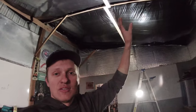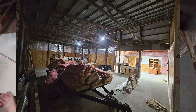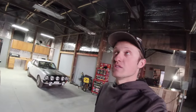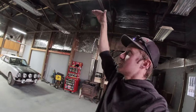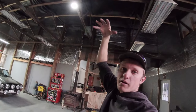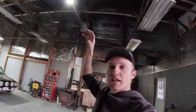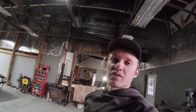To insulate the ceiling under that vapor barrier I got some pink fiberglass insulation. My uncle, when they remodeled the showroom at our farm machinery dealership here in Huntingburg, Indiana, had all that fiberglass stuff laying in their ceiling. If you build a ceiling in your building at the bottom of the trusses, you put a flat ceiling in and just lay that fiberglass on top — you leave the metal exposed, there's enough ventilation that moisture doesn't accumulate, or what little does the fiberglass will catch. I was able to score a ton of it effectively for free.